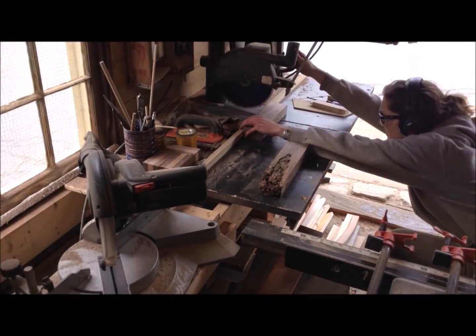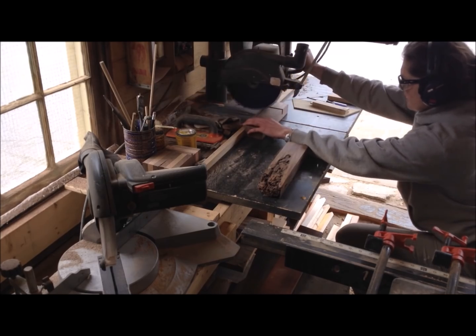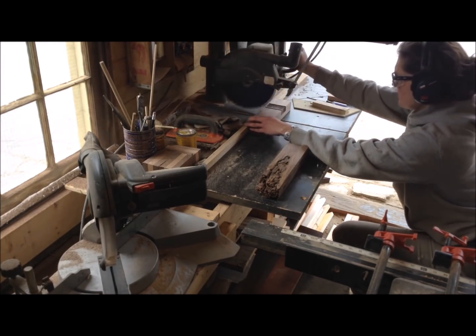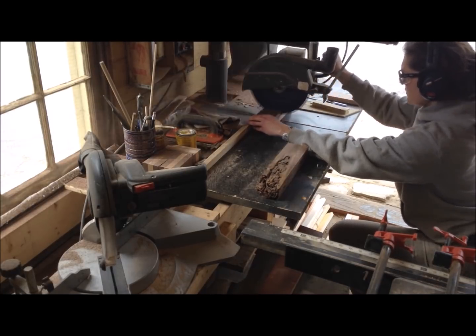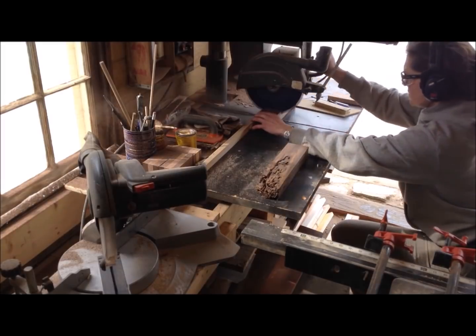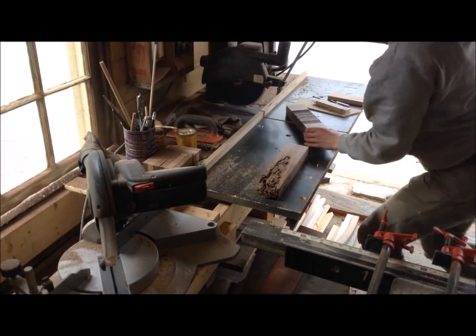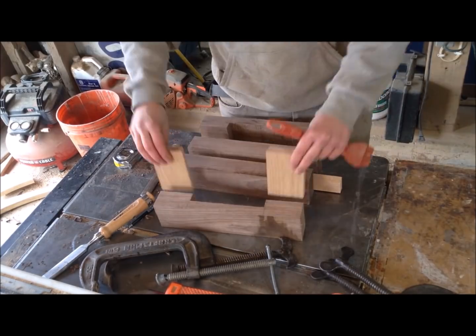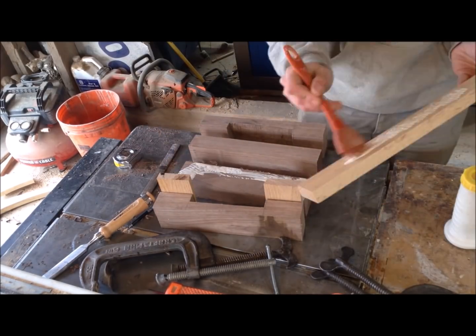To make that recess more prominent, I went through with my crosscut sled, raised up, and I cut a very long dado along this edge. There's faster ways to do this, but this goes by fairly quickly. With all those curve cuts, I can then clean out the excess, and then you'll see I'll have a rather large void in that piece now.